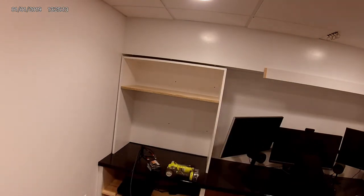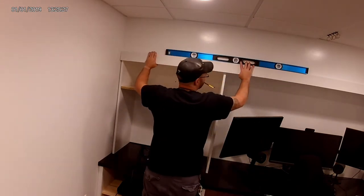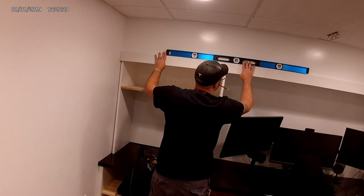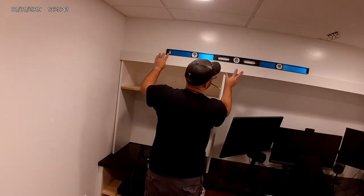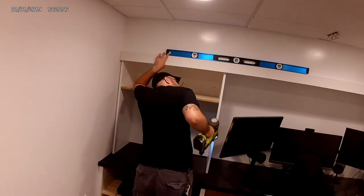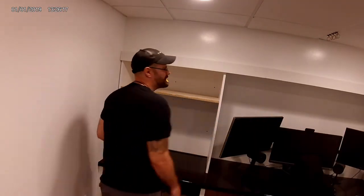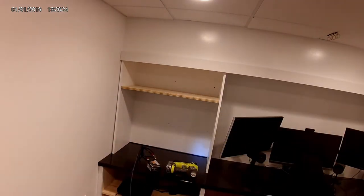I use a 45 degree here, actually flip everything around, and instead of that seam being on the left, it's now on the right. But I was able to use everything over again, and that was good. Essentially there's some trickery of the eye here. There's a 1-inch drop from left to right, and you usually use this face frame. So you create your shelves to be the same size. Whatever gap is gonna be there is gonna be there. And then from there, you're going to use that face piece I'm putting in to do some trickery of the eye for that wall drop.